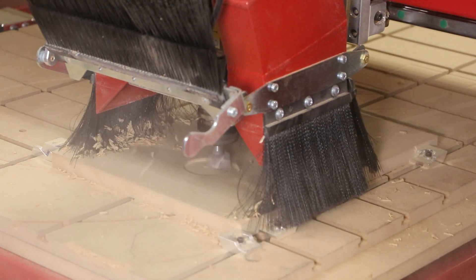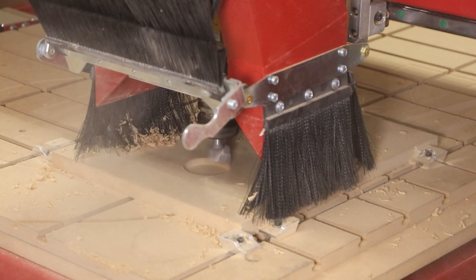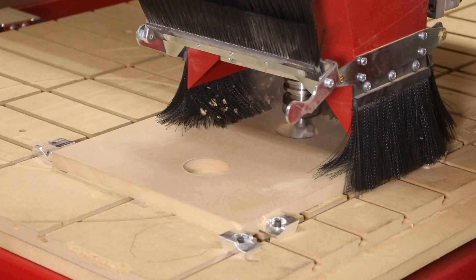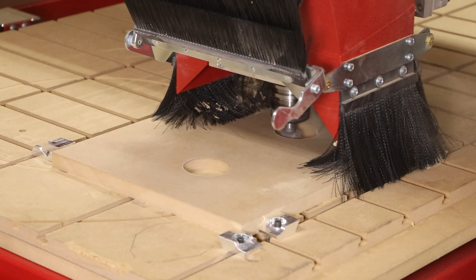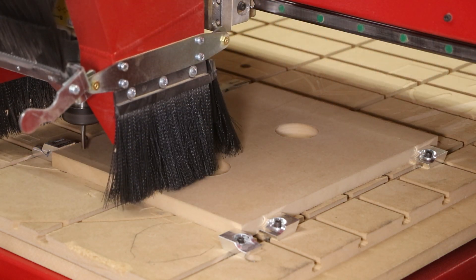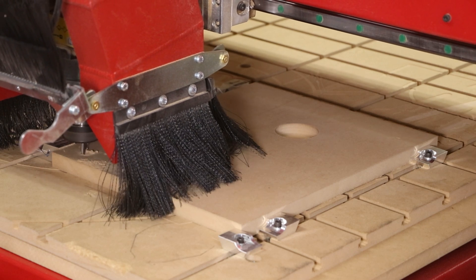The vertical workstation adds the mortises to attach the legs to these threaded nuts. Because the parts we're about to produce receive a threading process, we're going to need a pocket that is directly under the threading section so that the side V cutter doesn't bottom out on our table surface. Instead of cutting these round pockets in the T-slot table, we're going to use a fixture plate.